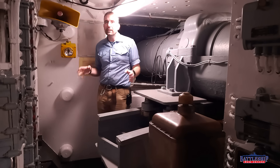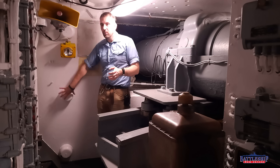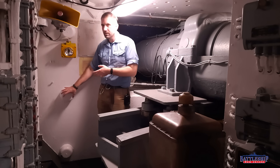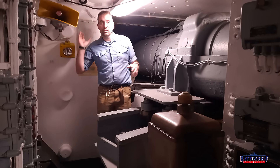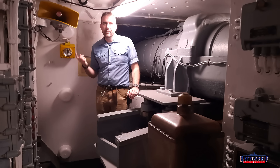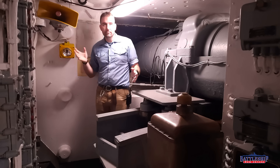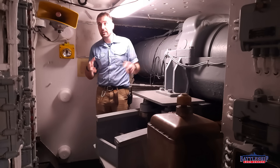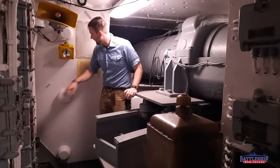The turrets are very well armored, so the bolt head or rivet head — whichever this one happens to be — is inside this protective cap. If that shears off and bounces around, it's just going to ricochet like firing a gun in a metal box. People are packed in here, so it could take out some guys — so the Navy went an extra step and welded these in place.